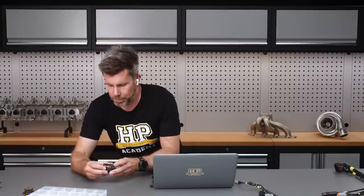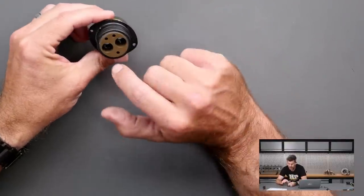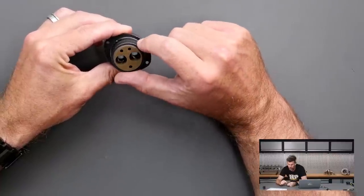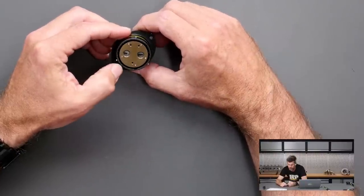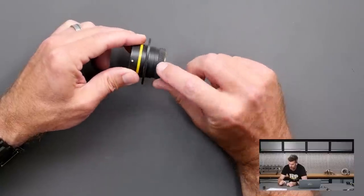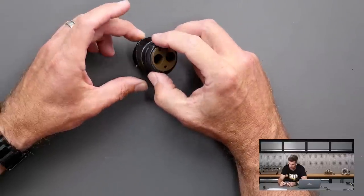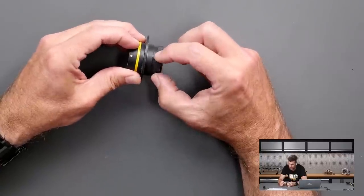All Autosport connectors are designed to work with the Raychem or Hellermann heat moulded boots. On the back of the connector you can see knurling along with a little machined lip — that lip takes the matching lip on a heat moulded boot, and combined with the epoxy and that knurling, it means it's positively located and it's not going to come off. Great product but expensive and requires a little bit of knowledge to work with.